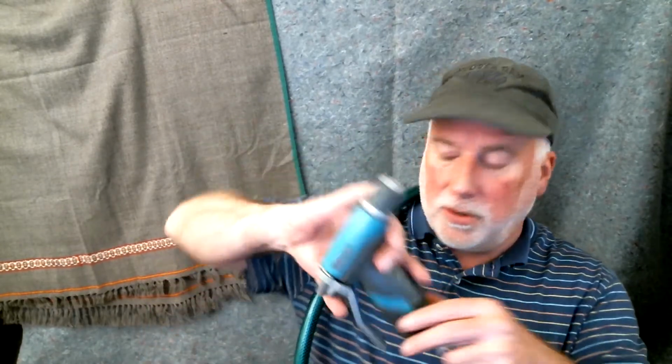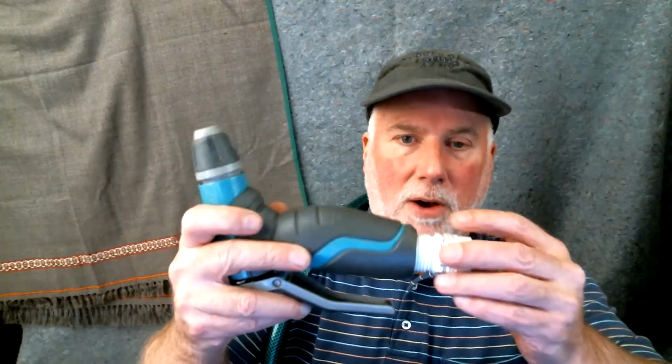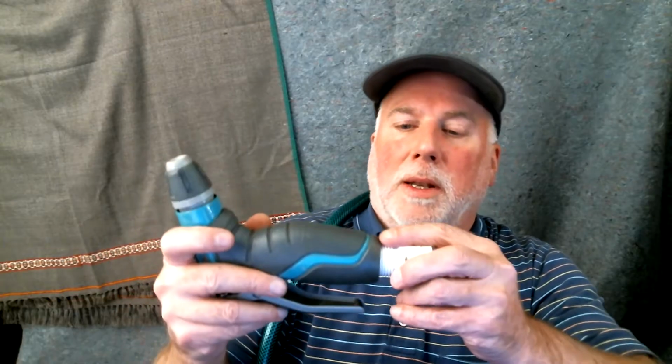Now, I want to demonstrate this on two nozzles that I bought 3 years ago, and I'll be posting an update on these nozzles. But I think in my original video, I was demonstrating this, and I screwed it into this very nozzle, and it tightened down so quickly I was kind of surprised while I was making the video, and I think that caught some people by surprise as well and led them to believe that this piece is in fact not the right thread. It's not a hose thread, but a PVC pipe fitting thread, and that it was getting snagged because it was different thread types, but it's not. So I'm going to demonstrate that on this.